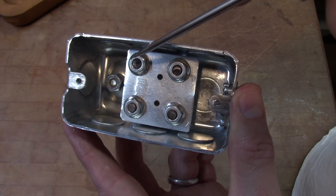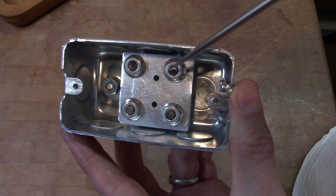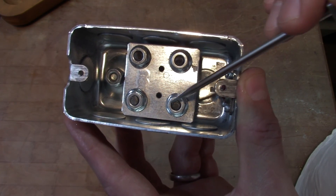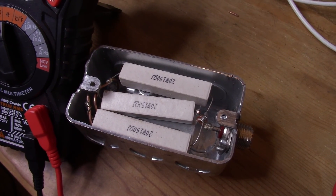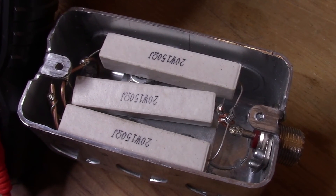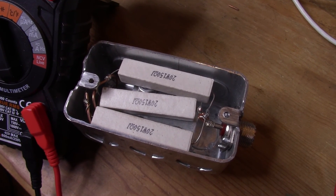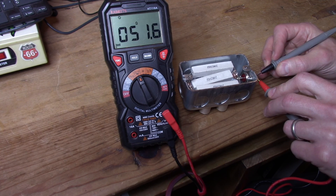The plan is to line up the resistors — one on top of these nuts, one down the middle, and one down the other side. It's not pretty, but all the resistors are soldered into place and I have measured continuity. Things are looking good. Let's test the resistance and, as you can see, dead nut right on 50 ohms. I'll call that a win.